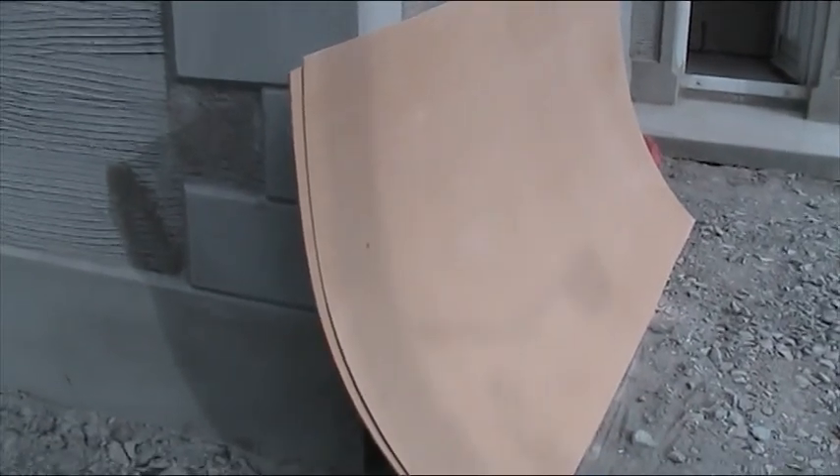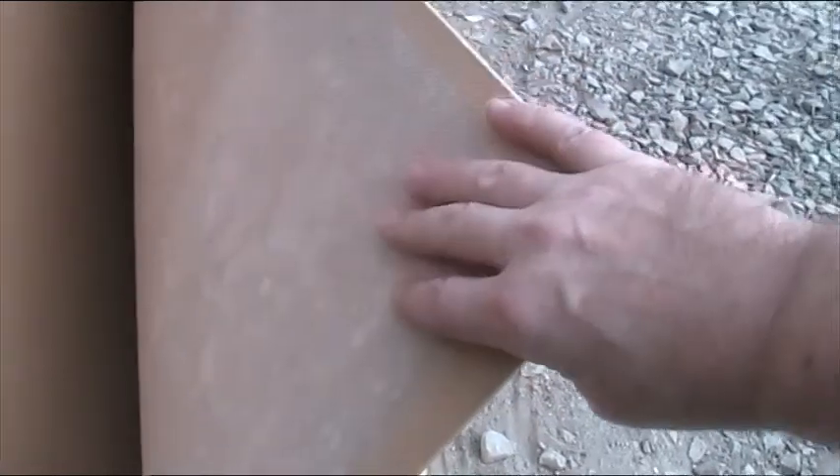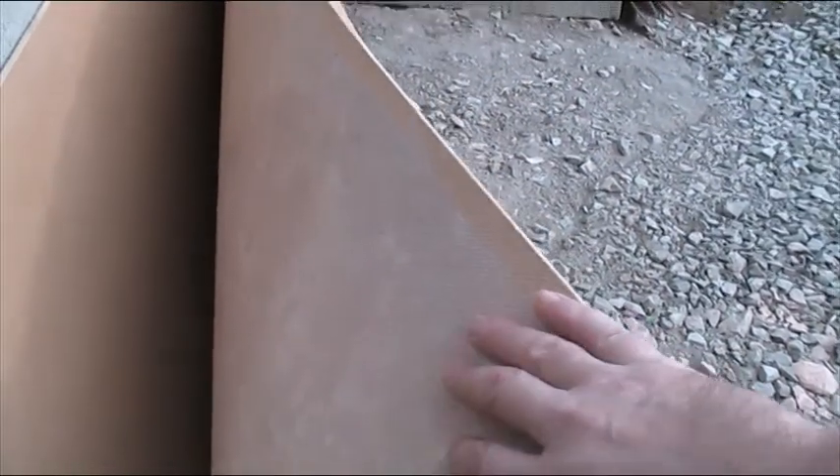Here's the hardboard I was using. Those sheets cost about five or six pounds each - about ten dollars - and I bought six of them which covered the whole front room and hall. For sixty dollars I saved the floor. Why are they so clean? Because all the dirt is on the back. When you put these down, put the shiny side onto the floor and the rough side up - that gives the guys something to grip on, especially those on stilts.